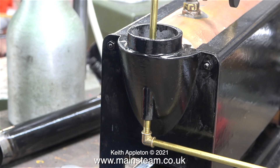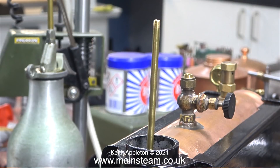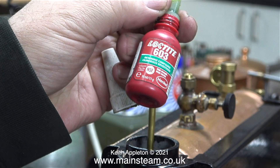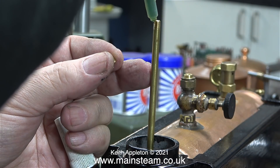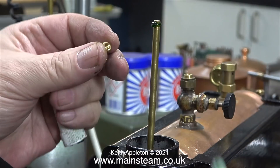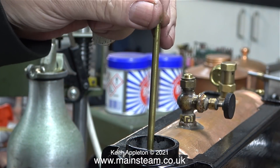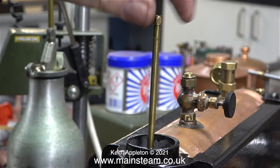The question is, short of using a pair of pliers on the tube inside the chimney, how am I going to tighten this piece of brass tube into the cast elbow below? The answer is very simple — I'm going to fit a nut on the top of the tube and use some Loctite 603 retainer to make sure that the nut, once fitted, doesn't come loose if ever I want to unscrew the pipe from the cast elbow underneath. As usual I applied far too much Loctite, but I was very careful to make sure none of it went down the hole in the middle of the tube.